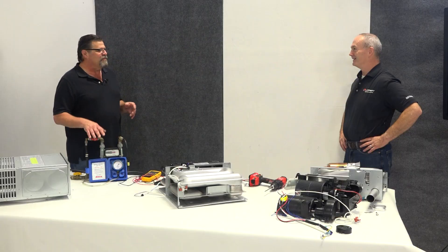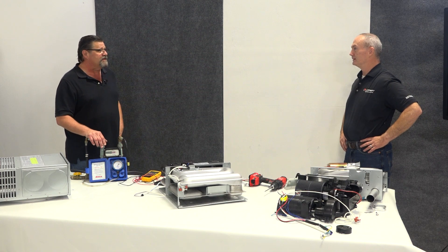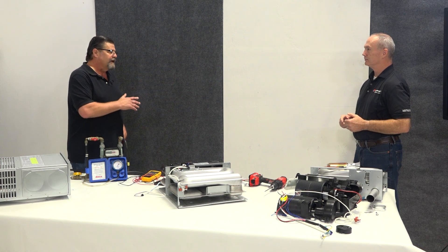You also want to make sure your return air is not blocked. There's a specific amount of square inches we need for return air — if you pile a bunch of stuff in front of the grill, it won't be able to get cool air in and it'll be warming up warm air. There are a lot of things that can cause this to overheat, but the main ones are hot air in the return, blocking the return air, or blocking the output air. Either way, you want good airflow over that heat exchanger.